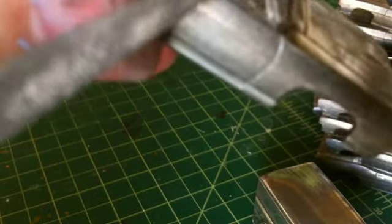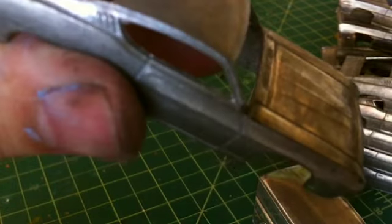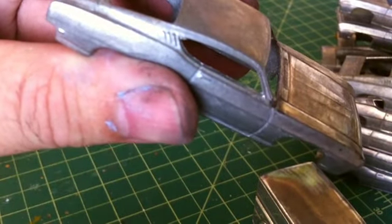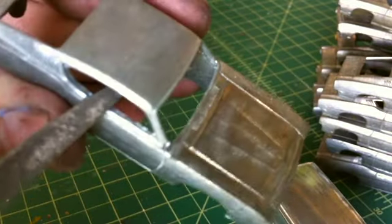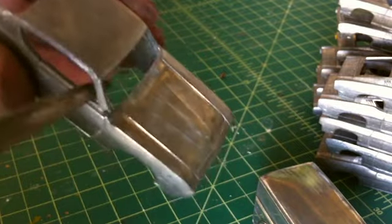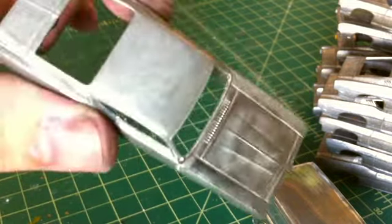around all that stuff. So can you see in there all that little kind of chewed up metal right in there? I'll focus for you. Right by my grubby thumb there. Come on, there you go. Right in there. And so I'll come in and file all that down using different files. And it takes a little while. So we would do that with this whole guy.